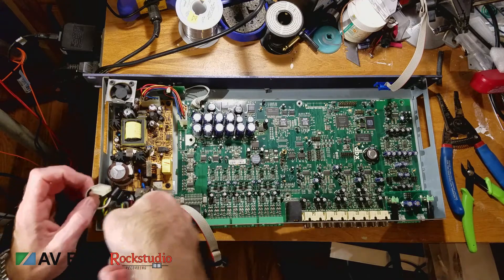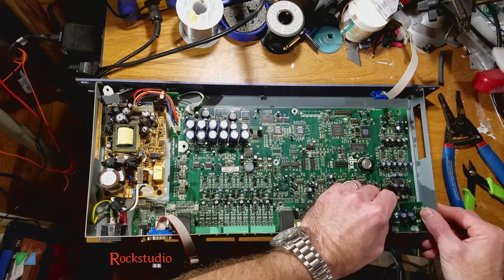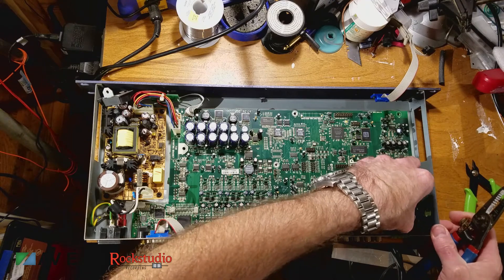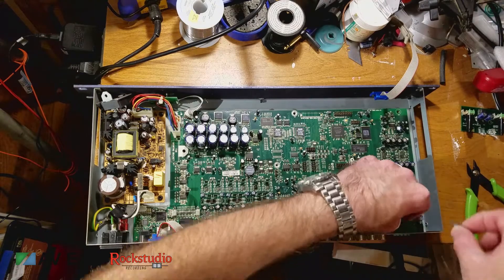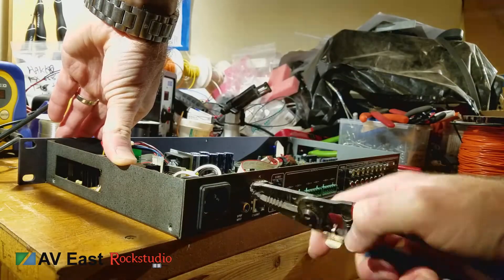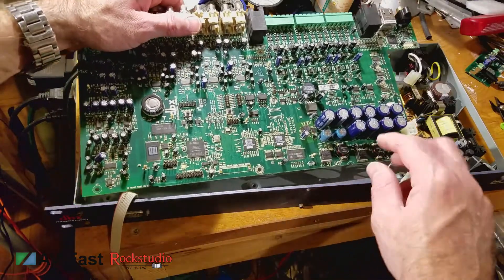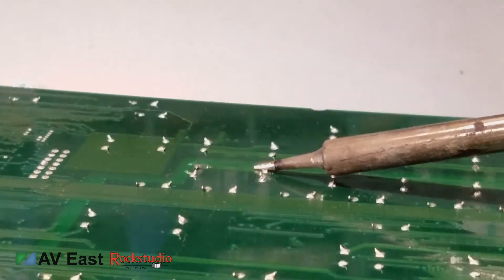You can use a C wrench to start to loosen all the standoffs on top. The trickiest part of disassembling and reassembling is going to be the daughter board for the mic/line input module. The trick is to push the little plastic lenses through gently before attempting to lift the back of the board up. While you've got this thing apart, I would clean all the contacts — especially those two switches by the mic/line inputs — and clean all the I/O connectors and even those serial connectors using some Deoxit. At this point, you've got to take off that serial connector on the back. I'm going to leave that ribbon cable connected on the front.